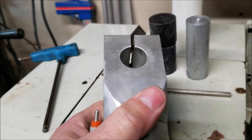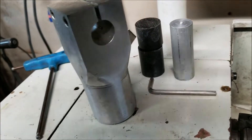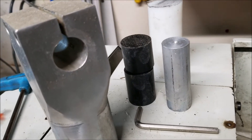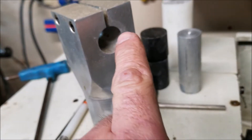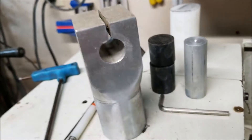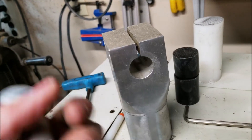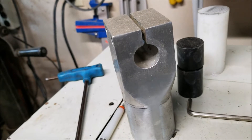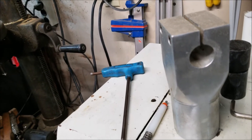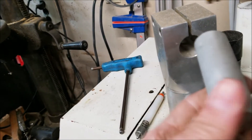I've got a machine behind me that has a spindle that fits inside this bore, so I'm going to turn this conglomerate junk of scrap metal into one that will fit in here. This way I can loosen the bolts, take the NSK spindle out, slide the drag engraver in, lock it in, and it's a direct replacement — you don't have to worry about losing your spindle squareness or tram or anything like that.